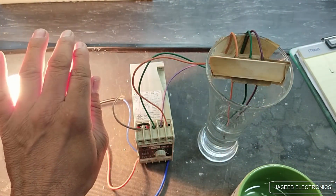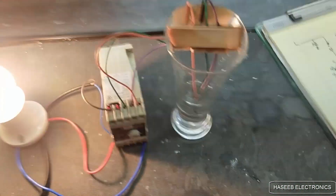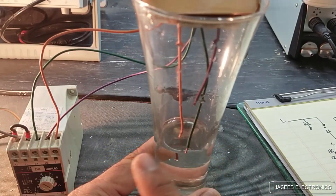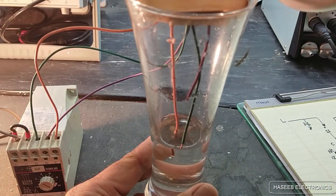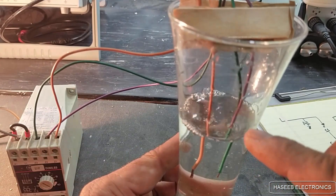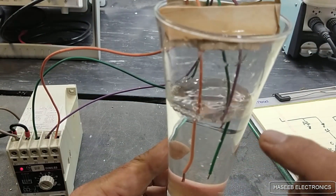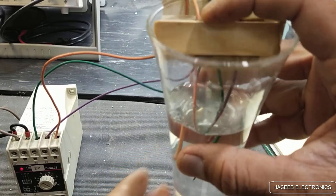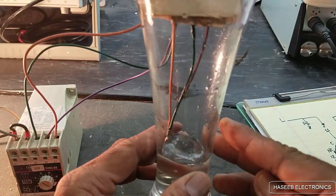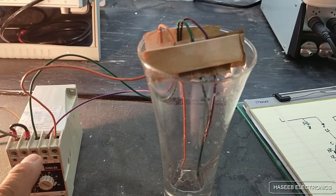The common line is still in the water. Now the water level is touching to the green wire and the pump is working — the lamp is on. I am adding more water. Yes, now it is turned off. I will drain water again. When the water level drops below the low level sensor Z3 — the green wire connection — it will start pumping again.